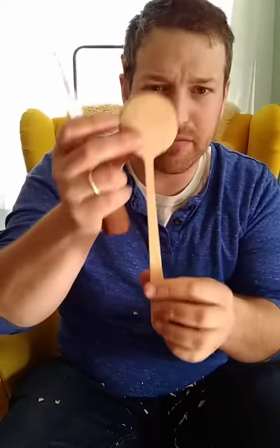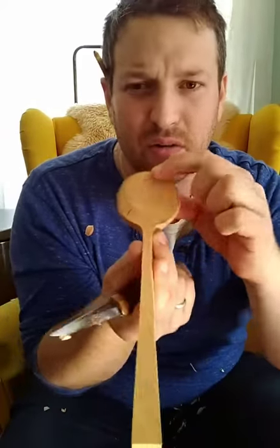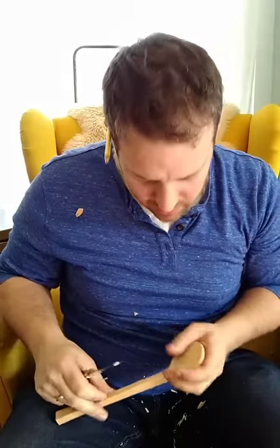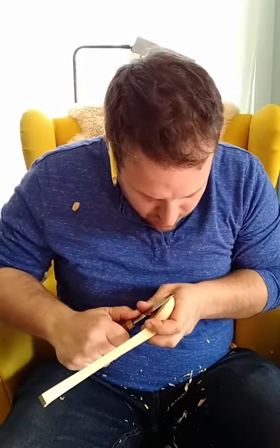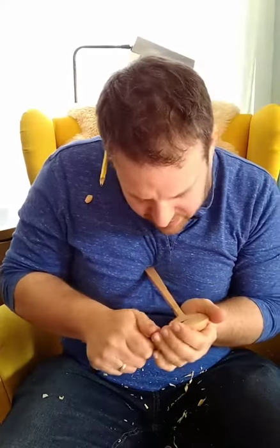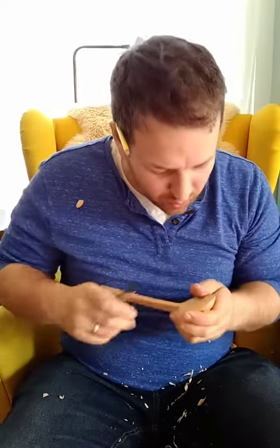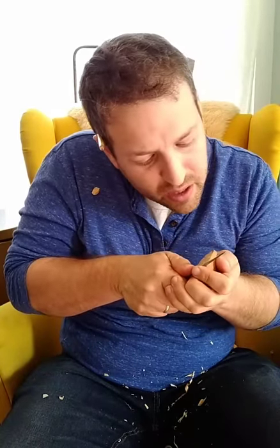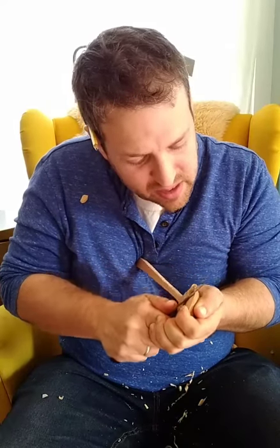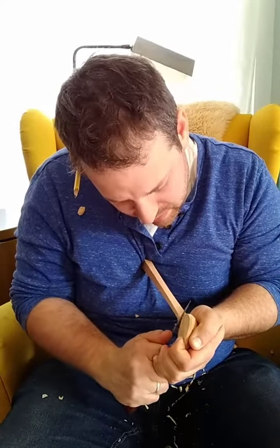Now that I've got the outline just the way I want it, I'm going to re-carve the rim, because in the process of doing the outline the rim is still wiggly again. So I'm going to redo the rim, get it right where I want it, and then pull the bottom of the spoon up to it — same as before except now I'm working with an outline that's clean and exactly where I want it. You can see why it's not worth spending a lot of time at the very beginning getting it perfect, because you're just going to be re-cutting it now — and it's just easier to do it the second time around because everything's a bit more refined.